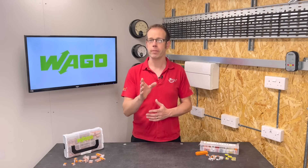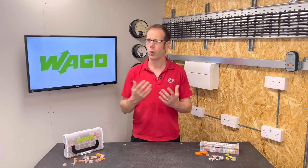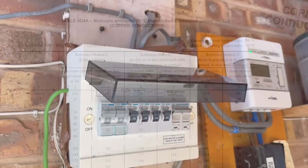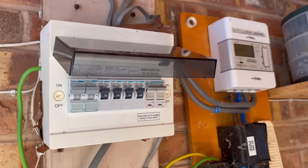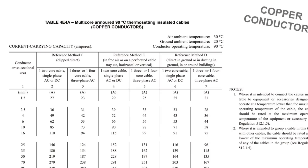But we're not quite on clover. First of all, if PVC insulated SWA isn't in general use anymore, why is Table 4D4A still in existence? Well, it's partly because you may need to refer to it when carrying out EICRs or modifying existing installations where it's already installed. But the bigger reason is found in one of the notes back in Table 4E4A.